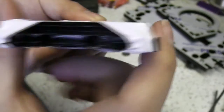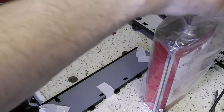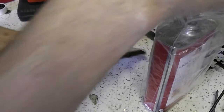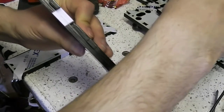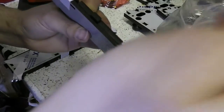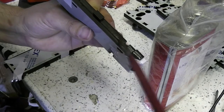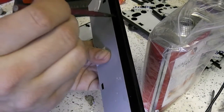I just had to make sure I lined the edges of the two pieces up perfectly. As always I'm going to be using solvent cement, just getting it on a brush and running it down onto the gap between the pieces. It will just get drawn in by surface tension and if you put plenty on it should glue the entire inner surfaces of those pieces of acrylic together.